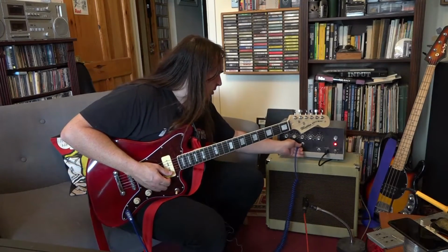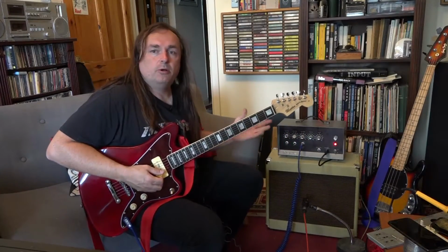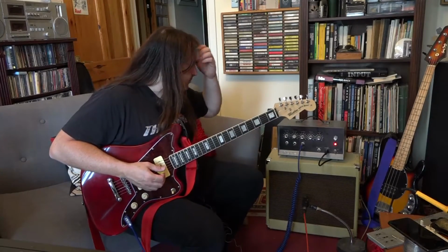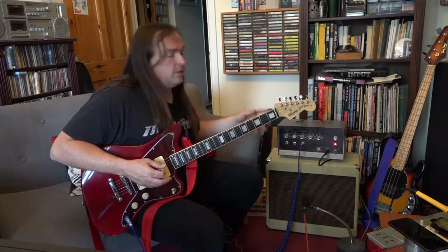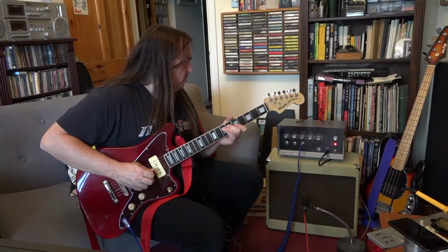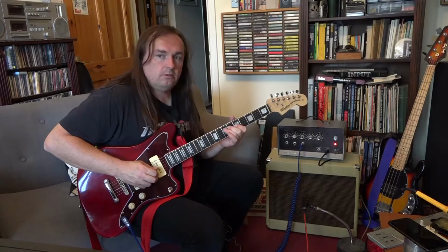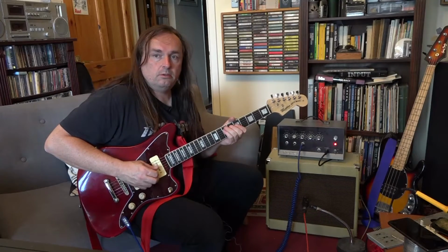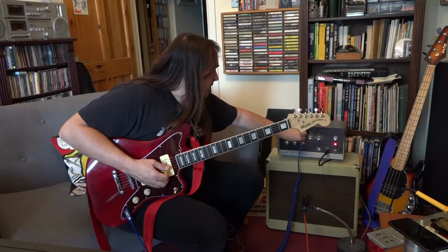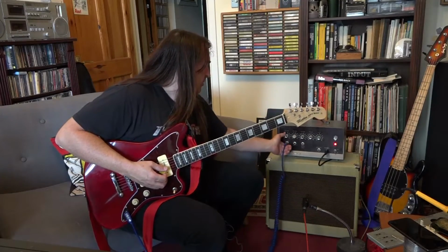If we go into the third input, I'm going to turn the knob to roughly the same position. But of course it's a lot quieter, and that's because it's a line level input. So as I said earlier, it's got one less stage of gain, but you can still turn it up. If I turn it up to full, that's probably maxed out my camera there, so it might have distorted, but that has that Elpico sound to it. But I'll go back into the main input.